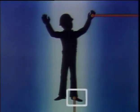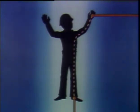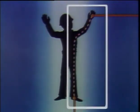Current flow is dangerous because the human body is a natural conductor of electricity. Current always takes the path of least resistance to ground, and that path may be through a person's body. We can use this illustration of a human body to see how current flow affects the functions of muscles and body tissue. If the left foot is grounded and the left hand touches an energized conductor, the shortest path to ground is through the left side of the body.